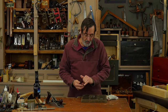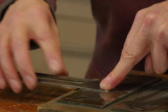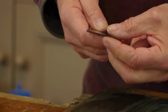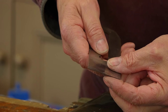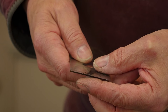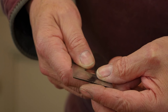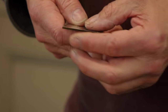This face has already been polished out — I don't have to do that again. So I flip over and I simply pull, and that pushes the burr — can you see it right there? I can see it — it's got a wire burr that came off straight away, right on the end of my finger. I just peel that off out of the way.